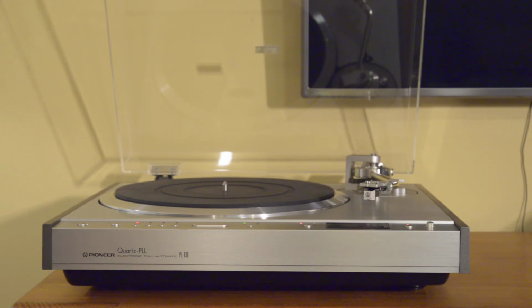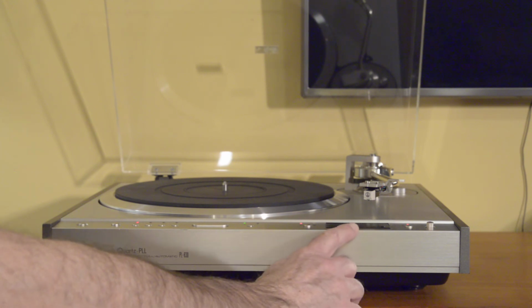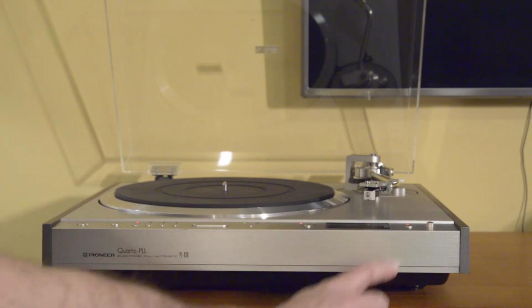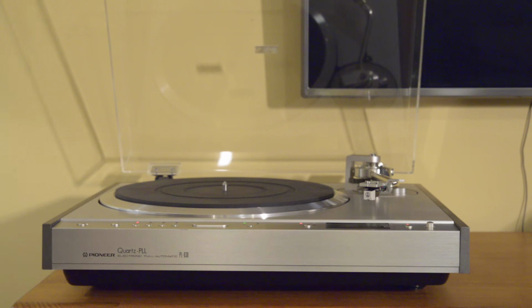Lead-in is adjusted, of course, and then all the checks, adjustments, and calibrations in Section 8 of the service manual, essentially all your electrical adjustments have been done, including from an operation standpoint, which is just a nice to have, the meter's been calibrated so that when the meter's in the 0 position, it's essentially at the correct speed, and then the plus minus 6% have been adjusted to be plus minus 6%. All the lights work. The meter comes on when switched, as I talked about, the light.